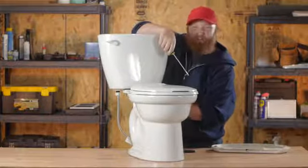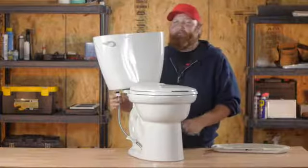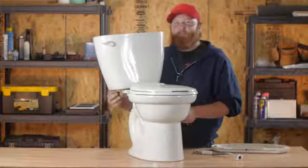After you get it loose you can apply a little bit of pressure onto the tank and remove those nuts by hand. Now you can actually remove the supply line to your toilet by hand by loosening at the top where it connects to the tank, and that should give you room to get to your next bolt.